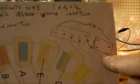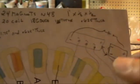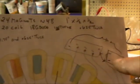So here's what we got. Well, first let me show you how I rectified it. We have A and B neutral point together, separate from C, D, and E. It has to be, otherwise it won't work. Most of you know that. And then we go to the rectification. A and B comes over, rectifies by itself, and then C, D, and E. And then we connect the 2 from minus to plus in series, so it adds up. And then we use the positive and negative terminals.